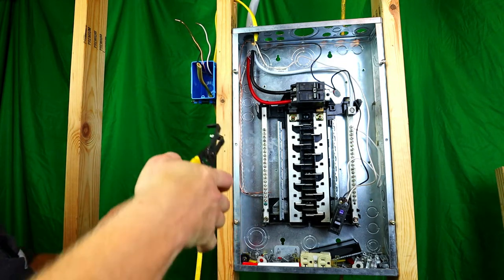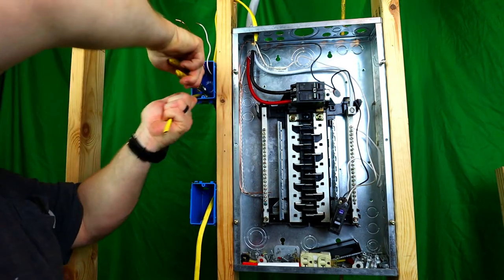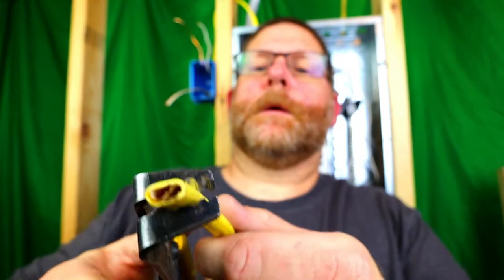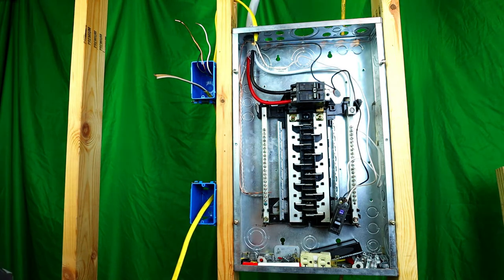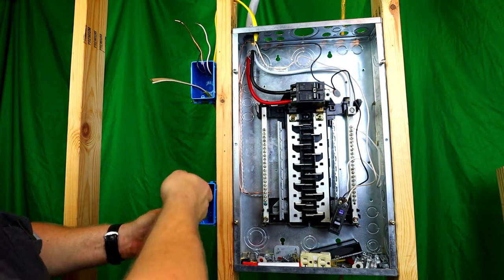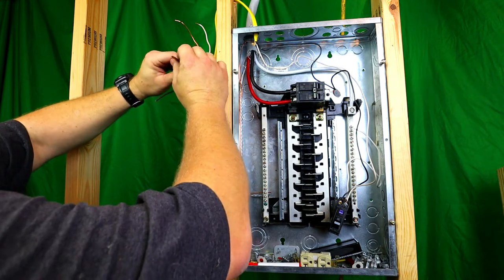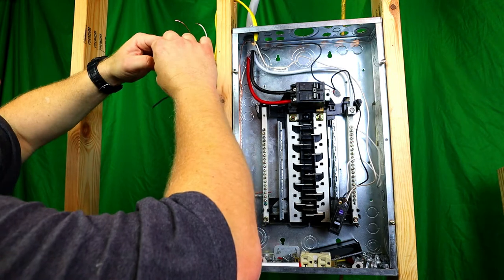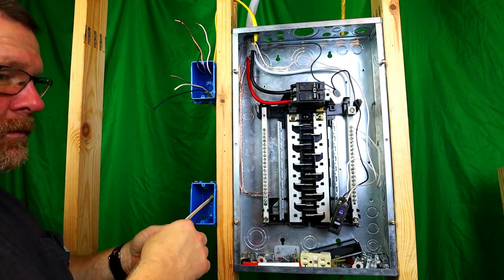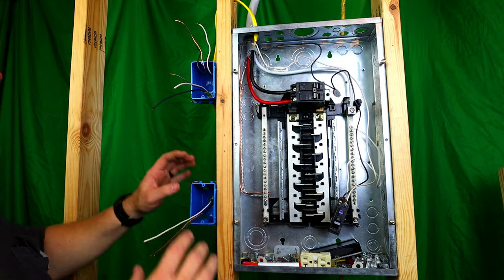These are angled, so we'll put these in here like so, give it a little shake, and we'll pull off the Romex. Basically, it goes in here and it just clamps on your wire — you clamp down on it, give it a little shake, and it comes off. I'm going to use something in this video that is controversial to my own electrical work, and that is Wago connectors. I'm not a huge fan of them — I will be doing a video soon about that. In this video I'm going to be using the Wagos so this goes faster.